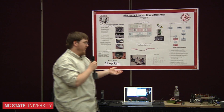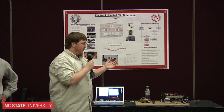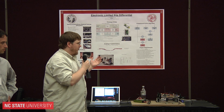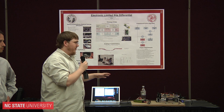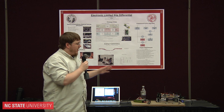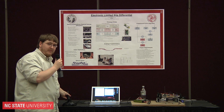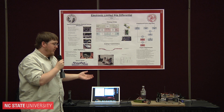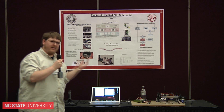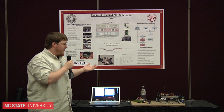For the hardware for this project, we've got an Atmel-based microcontroller. Along with that, we're using dual H-bridge speed controllers for the motors. The two motors are running at about 12 volts, which is the power source — a 12-volt lithium polymer battery. We're also using a servo for steering, and the motors have encoders. We're using a Bluetooth wireless setup for communicating with the robot remotely. The chassis was actually cut by a company called ShopBot, based out of Durham — a CNC router company that uses CNC equipment to cut parts like this.